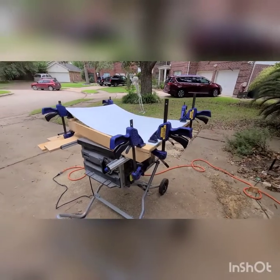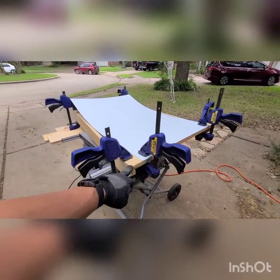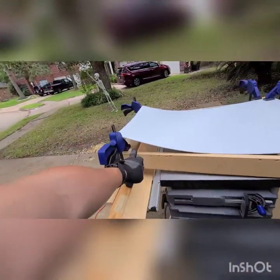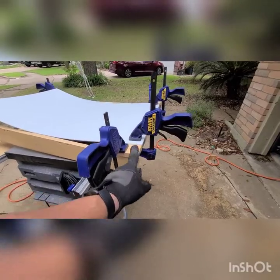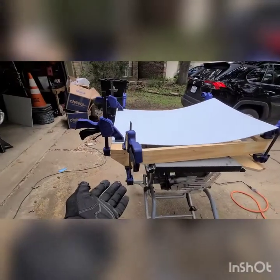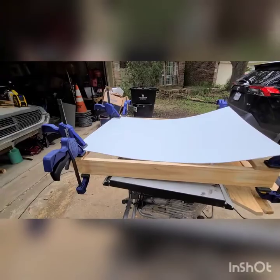On the four 36-inch boards I took a 45-degree notch out of the corner, about an inch in — that'll come in handy in a bit. When assembling, we've got the 28 and a half inch board on one end, the 23 and a half inch board at the back, and two 36-inch boards on the sides. The tapered end goes on the widest end so we can slot it up closer to the wire the rabbits sit on, giving us a better slope for collection.